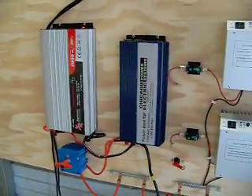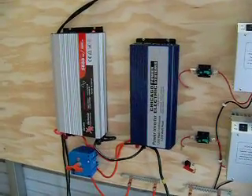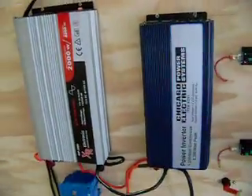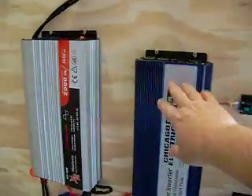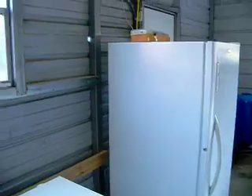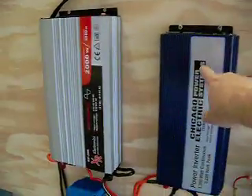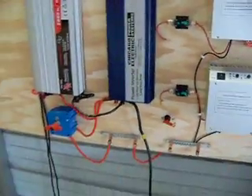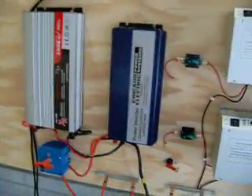I'm still going to be able to use my 12-volt inverters that you can see here — there's a 2-kilowatt and a 1.2-kilowatt. This one is a pure sine wave; this one is a modified sine. The modified sine won't run some of my appliances — that freezer there will not run at all with this inverter, but it will run fine with the pure sine. The modified sine will power all my tools and lights no problem. The other freezer is one I got from Sears; it has some new electronics and its computer just doesn't like the modified sine at all.